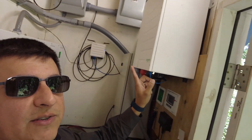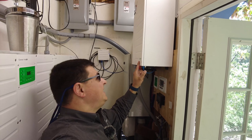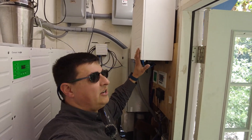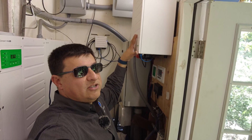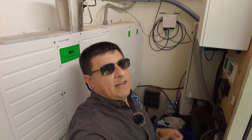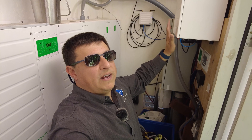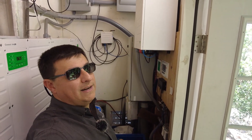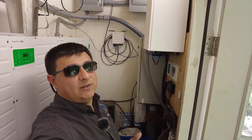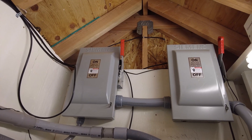So what we did was use this unit as a 60-amp, 48-volt DC charger. It's just connected directly to the generator — when the generator powers on, this charges the 48-volt battery bank, and then the inverters pull power off that 48-volt bus. This ended up being a lot less expensive than other 48-volt DC chargers I was looking at, and it gives us an extra layer of redundancy.